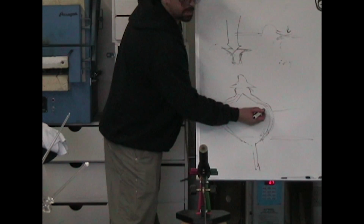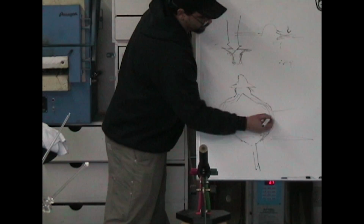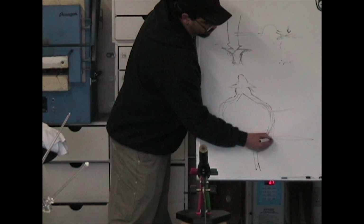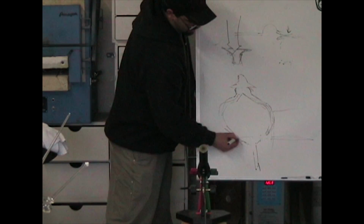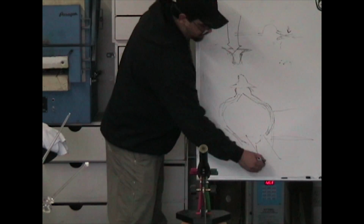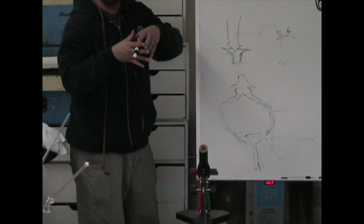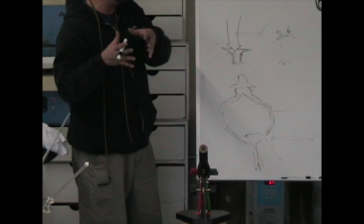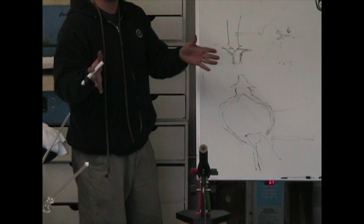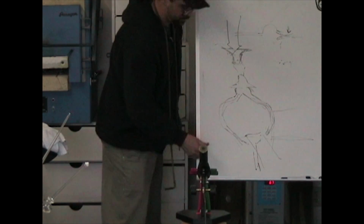And this will stay stable back here and won't be flopping around. So the heat hits that, this thickens up, centrifugal force slowly starts to open it up, and then I aim the flame dead in the front of this piece, and the deflection of heat and the deflection of the flame up against the back of the shoulder will just spin it out flat. And all of that's done after these two pieces are attached.